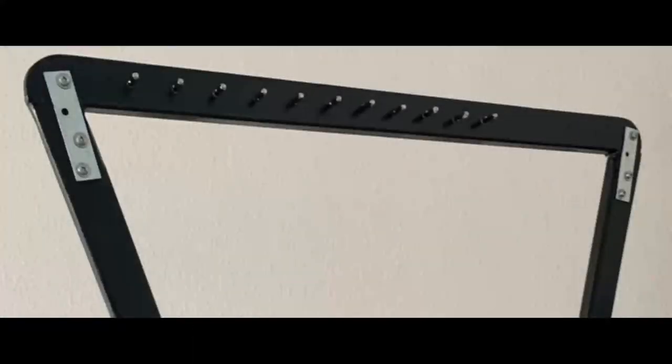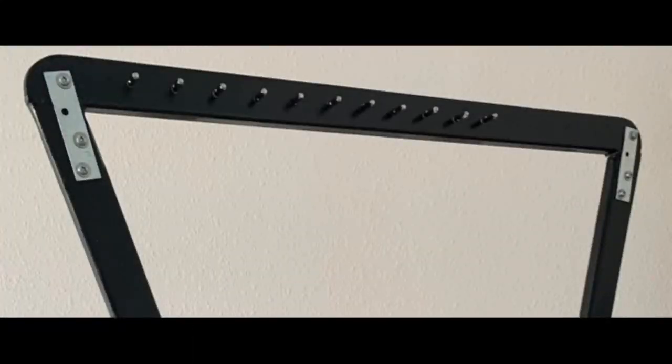To address that first issue, I bought and affixed metal strips to each side of the connection between the top bar and the supporting struts, and then bolts and nuts were used to connect the strips on each side. This solution has proved to be very effective — nothing so far has caused those strips to bend or move in any kind of way, and I haven't had any further issues in this area.